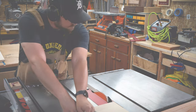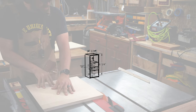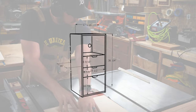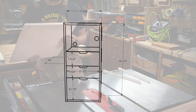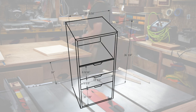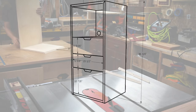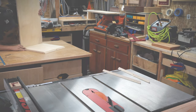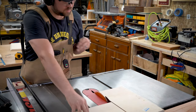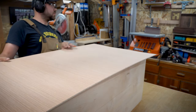Here's the plan. We originally were going to put the printer and the ScanSnap on top of the whole cabinet, but putting the printer inside not only cleaned up the top, but also allowed the ScanSnap to be on its own. I originally started with two bigger top drawers, but made those thinner once I realized I just wanted basic pens, pencils, and general desk knick-knacks in there. This is a really specific build for my office, but easy to adapt — it's just a rectangle with the top piece mitered at 45 degrees to connect with the side pieces, and the bottom piece butt-jointed with pocket screws.